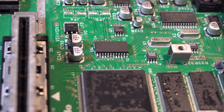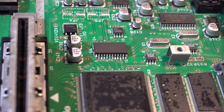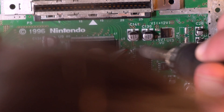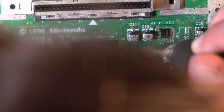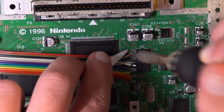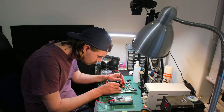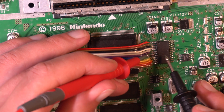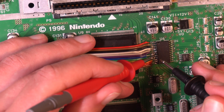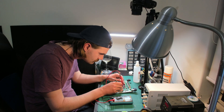Here's what it looks like with everything cleaned up and pre-tinned — much nicer. I also checked all the pins with a multimeter just to make sure there was no bridging between them. Now it's time to solder one wire to one pin. This was as fiddly as it looks and a little bit messy, but after a sore neck later everything was done — and amazingly there were no bridges between any of the pins on the first go, probably more dumb luck than anything.